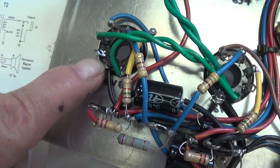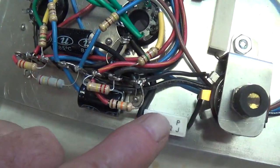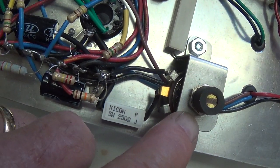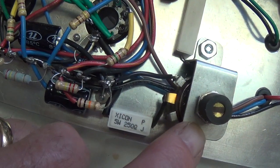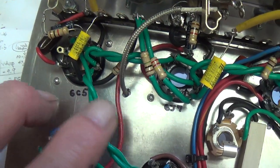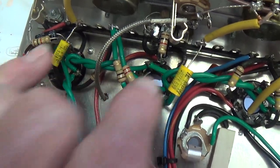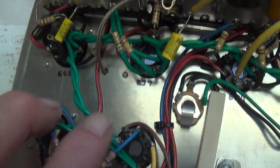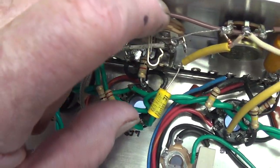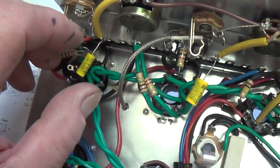I moved the 250 ohm bias resistor that you saw previously from this position over here and put a precision 5-watt pot in series with it so that I could have adjustable tube bias. As I told you before, I moved the 6C5 and 6J7 up to the front and moved the output tubes to the rear so that these fellows here, the preamp tubes, could communicate easily with the input jacks and the volume controls with short leads.